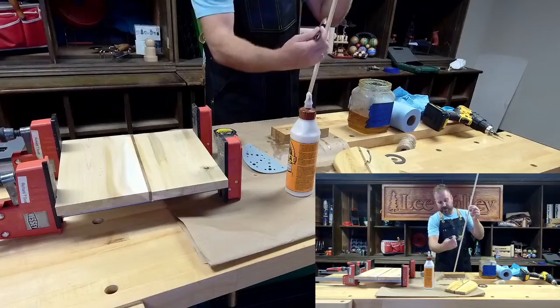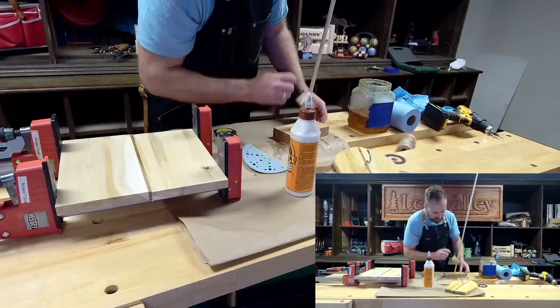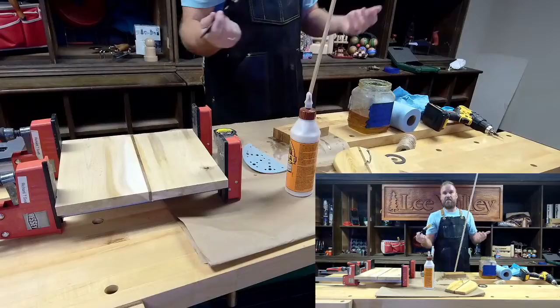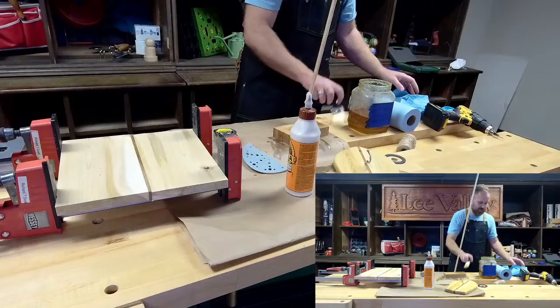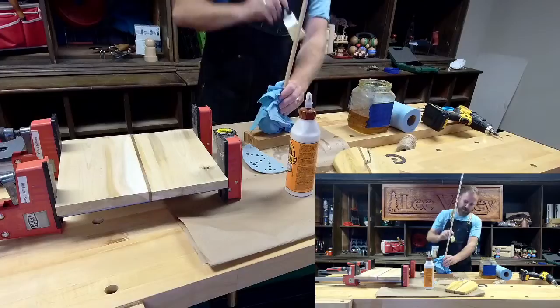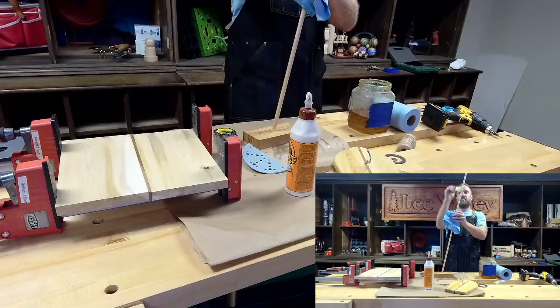When I start with boiled linseed oil I always have a mix that starts at about 50-50. Then as I get more and more coats onto the piece, the mixture changes — leaning more towards the heavier side for the linseed oil. You want to make sure you remove any excess because linseed oil or any kind of natural oil will get really gummy, and then you'll have issues with it never really wanting to dry. I always let stuff dry for overnight — usually 12, 14, 16 hours. Glue manufacturers will tell you that you can take the piece out of the clamps after 35 or 45 minutes, but that seems like a bit of a rush. I tend to want to make sure it's nice and solid.